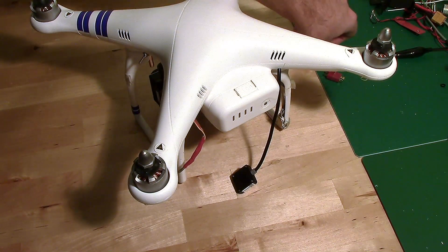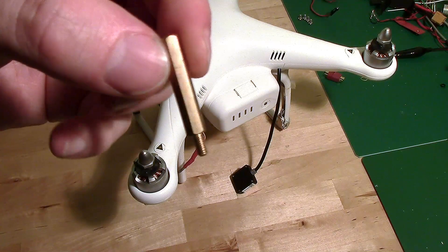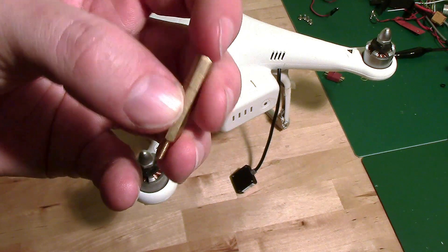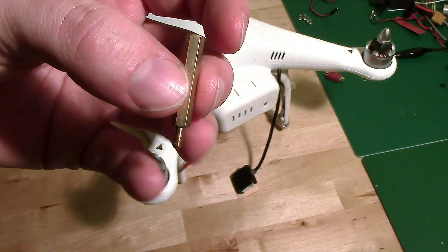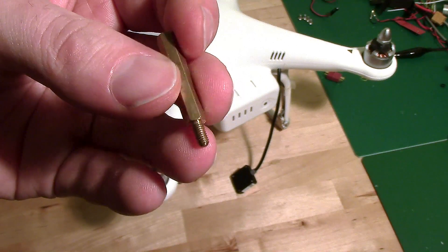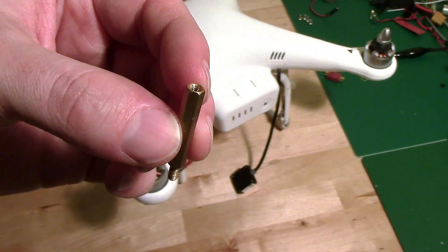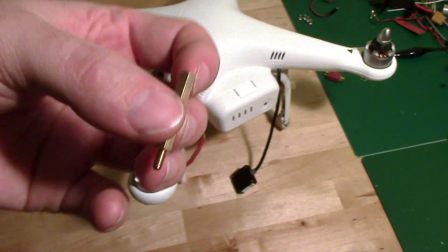To mount it, all you're going to need is some of these. These are just hex brass spacers. You've got an M3 thread on each end and it's 25mm high. You can choose to have it a little bit higher. You can get nylon ones, but nylon threads can get stripped very easily — these brass ones will give you a much more positive feel. We use them and that allows us to use the original screws from the Phantom. That's literally all you need, plus a screwdriver.